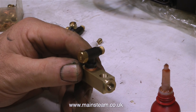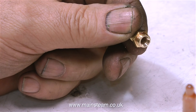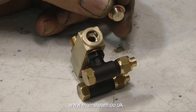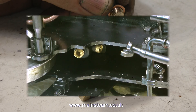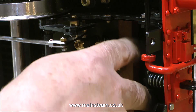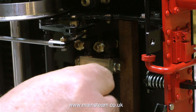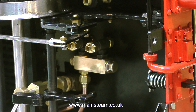Once I've finished drilling and threading the cross holes, I machined the end of the part just to improve the appearance. Then I made the union connector to connect the adapter block, via a pipe, to the clack on the boiler. The main hole through the fitting is 5/32nds of an inch in diameter, but for a distance of a quarter of an inch at each end, the holes were threaded 5/16ths by 32 threads per inch. I put two blanking plugs in — purely decorative. Even though this part is out of sight underneath the footplate, it looks more like a purposeful steam fitting.